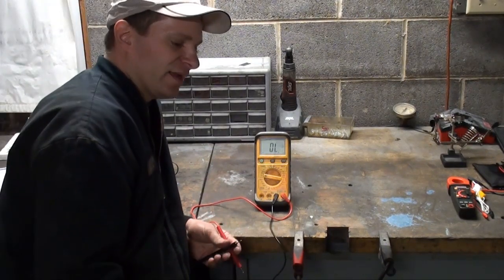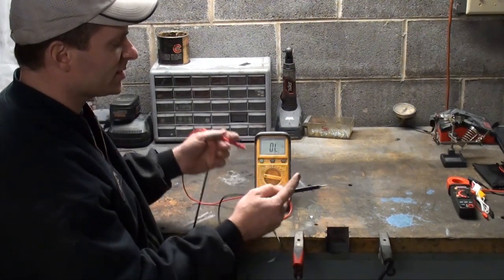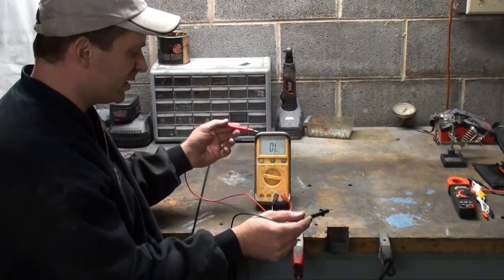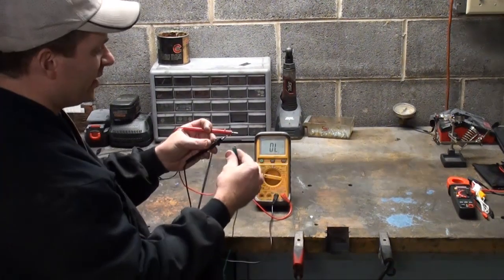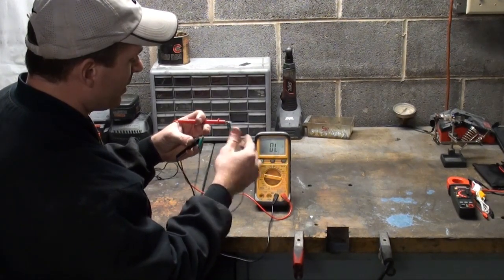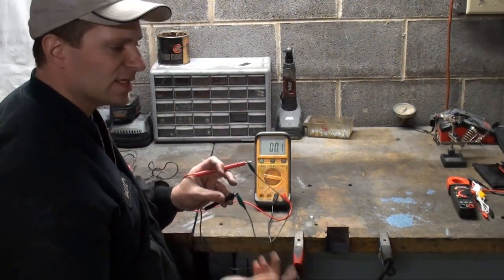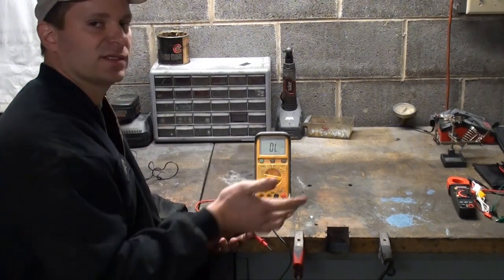If I have a connector that I'm thinking might have failed between two points, I'm going to check each side of that connector and it will tell me if I don't have a continuous loop — if I'm not continuously flowing from this side of the connector to the other. Or I can take a piece of wire with alligator clips and put one on each probe — it's a continuous loop. If I snip that wire in half, it's going to be an open loop, not continuous. That's what the continuity check is all about — to see if it's a continuous loop or not.